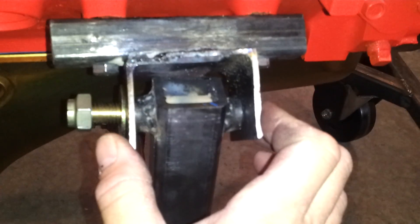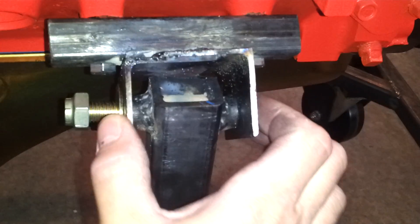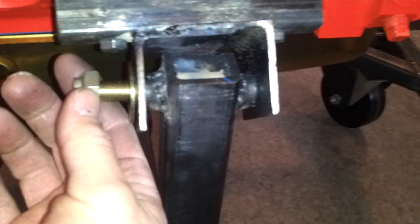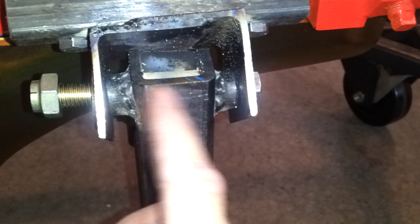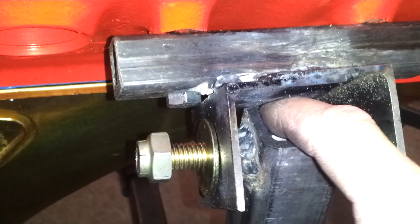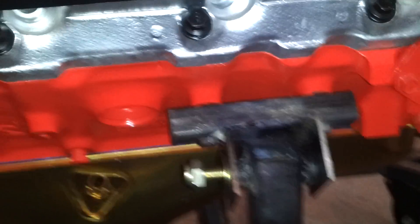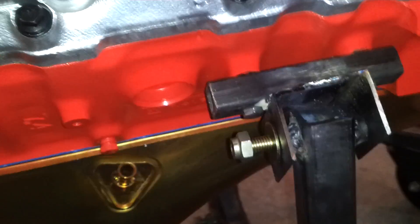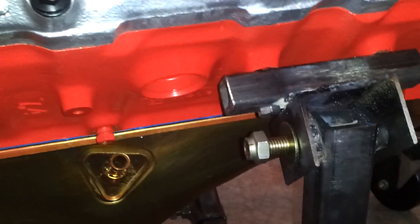My angle is 1/8 inch. Some people think that's a little thin, but the strength is oriented the way I'm using it, not side to side. I had a piece of pipe where I went through this 1½ by 1½ by 3/16ths, welded the pipe in. Then on the back side, which you can't see, I had to kind of angle that down to give it clearance. I put the headers on last night — they do fit. It's pretty close in there, but they fit and they clear.